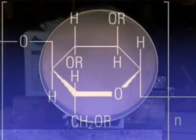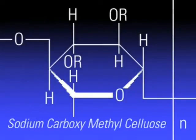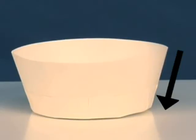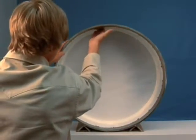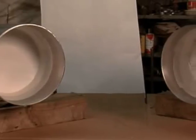EZ Purge is made of AquaSol Water Soluble Paper and Tape, Sodium Carboxymethyl Cellulose, and Wooden Pulp that dissolve instantaneously and completely in most liquids. For quick installation, the side walls of EZ Purge are tapered to fit different pipe schedules. Additionally, all EZ Purge include a generous portion of water-soluble tape pre-installed in sections to allow for carefree alignment and tacking. The shape of EZ Purge is flat, similar to a mechanical device, to allow equal distribution of gases across the body of the dam.